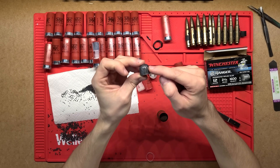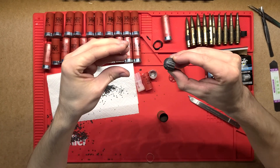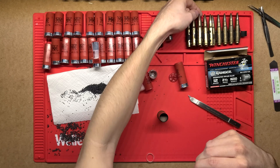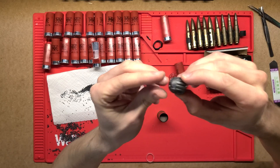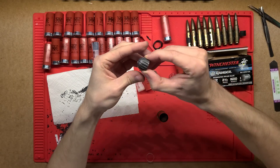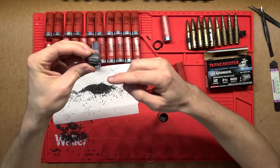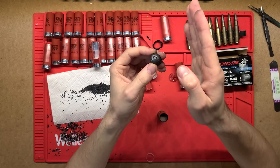So the reason for the rifling is because you shoot this out of a smoothbore shotgun — the actual barrel will be smooth, but because of the rifling on this, it will actually produce rotation as this travels through the barrel. The reason that happens is the same as your standard projectiles, except in standard projectiles the projectile is smooth but the rifle barrel is actually rifled — hence the name rifle. So the projectile will actually spin as it travels through the barrel and continues to spin in the air. The reason it does that is it just keeps much better stability than if it just tumbles through the air. But if it does spin, it'll keep that momentum and travel in a straight trajectory — a lot more precise that way.